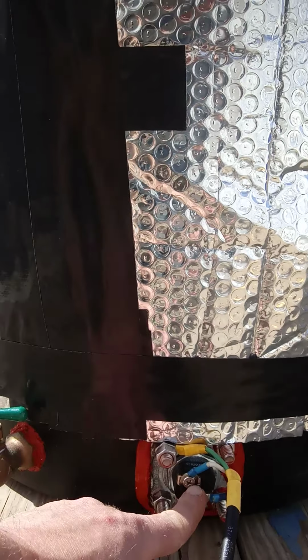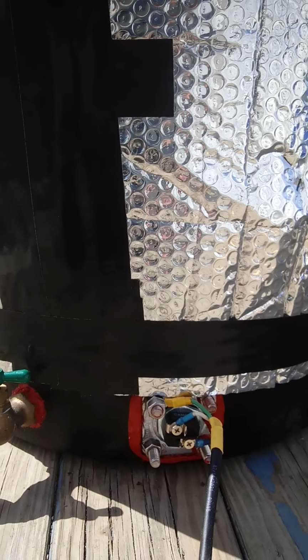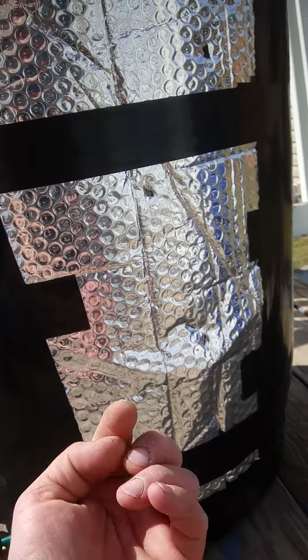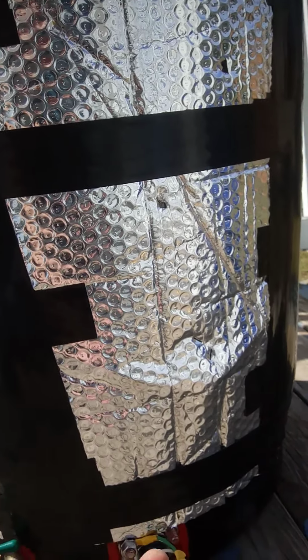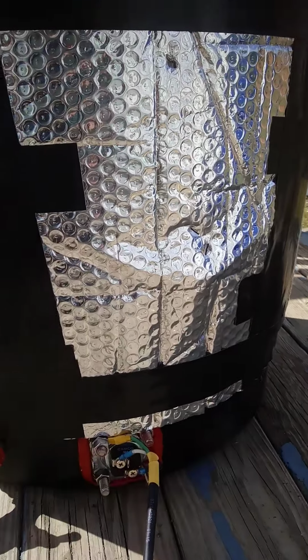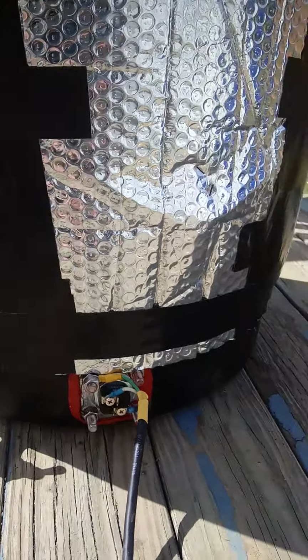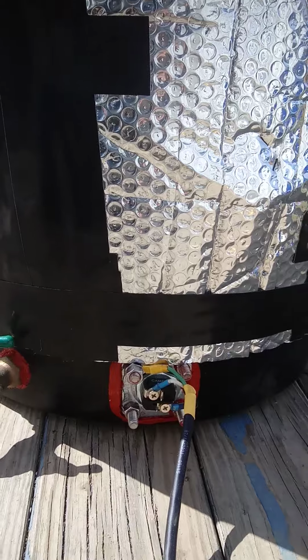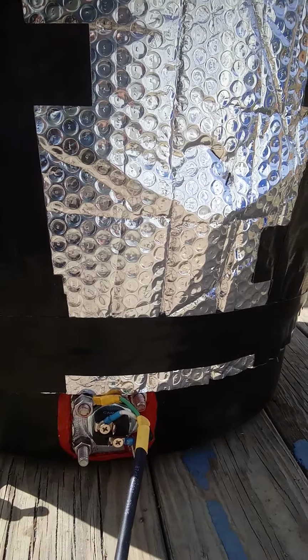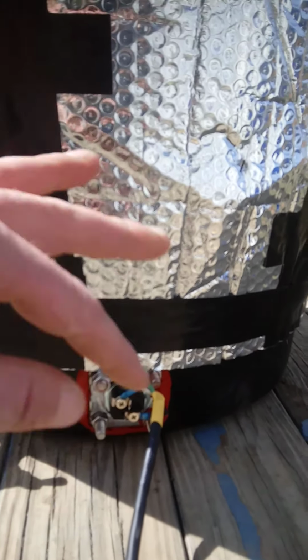This hole I drilled with a hole saw. One of those things. It's round, and then it has a drill bit up, and it's a sort of a mechanism. It's a hole drill bit, and then that's what I drilled in. And then when you're done with that, you take a knife and you clean off all the burrs, and then you take some RTV and you spread it around on that stencil that you drew, and then you pat it down and whatnot.